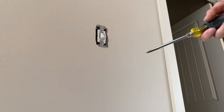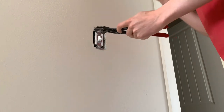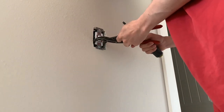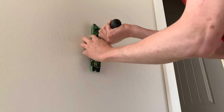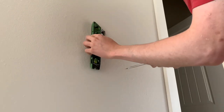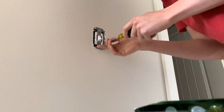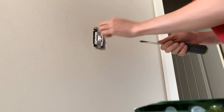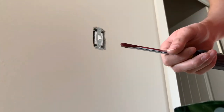Make sure it's not loose — looks pretty good. You can always use your screwdriver to level it out or your channel locks. Don't grab anything that'll damage it, but you can grab the outside and twist it one way or the other if it's crooked. I'm going to grab my level real quick and set it right here on the side of the switch. It's not quite level so I'm scooting it one way or the other, getting it right there. Lock it in place, tighten it a little bit — nice and tight, give it a wiggle, double check it, and it looks good.